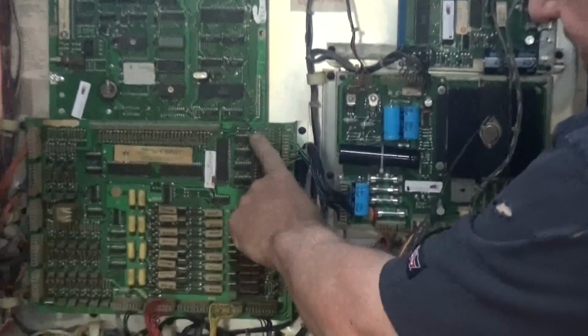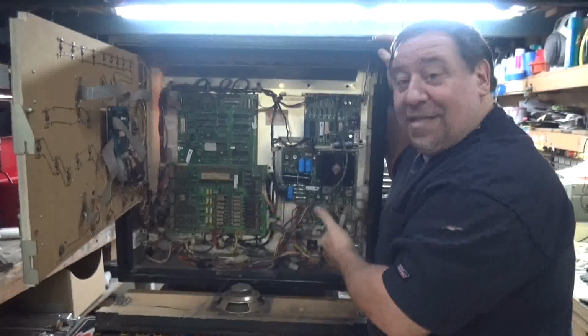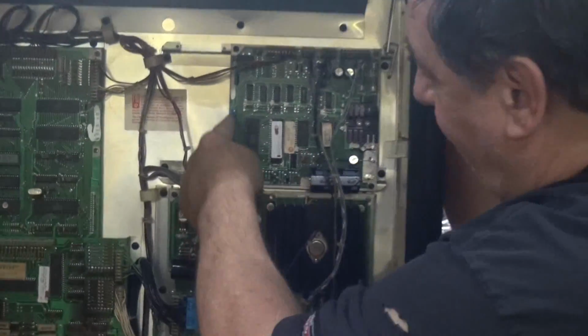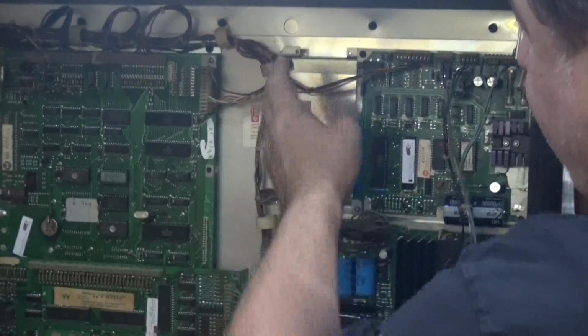We put the jumpers in the switch line. See right here? You change those. It makes the switches a little more responsive. That's important when you play the game, I think. Now, here's the soundboard. See, it still had the connector. The speech board in FIREPOWER mounted here, and their brackets will still support it.